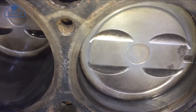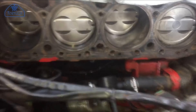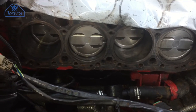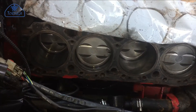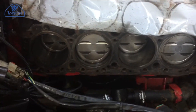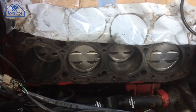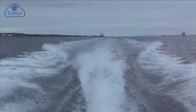So I'm going to start cleaning with some brake cleaner and I'll leave that to dry overnight. And then I'm going to come in here, take the water pump off, rotate the engine round by hand a couple of times, and then give the bores another clean and vacuum them out with any other debris that's in there. And then we can start to put it a little bit together.